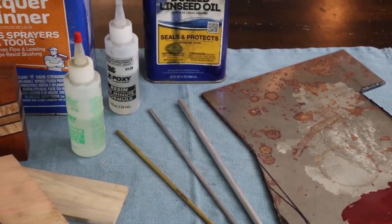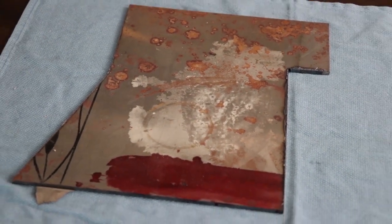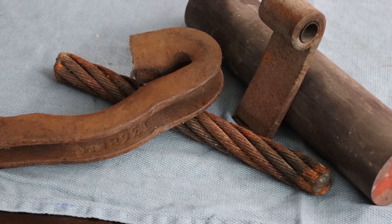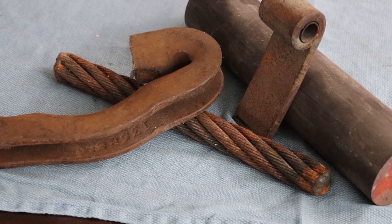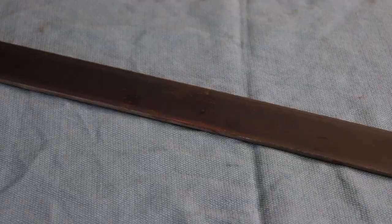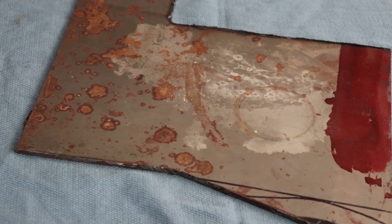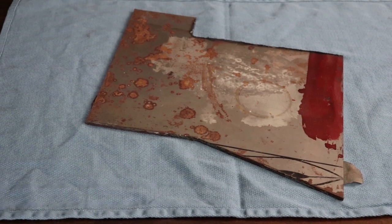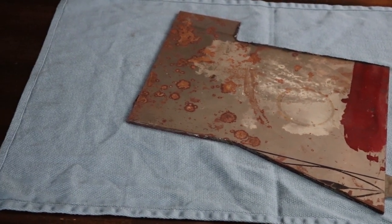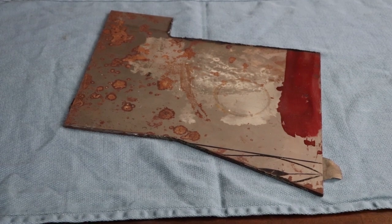That brings us to materials. Most importantly, you'll need a piece of flat high-carbon steel from the mill, like this piece of 1095. Since we're making a stock removal knife it's very important that the steel is perfectly flat — railroad springs, cable, leaf springs, truck axles, these are all a no-go for your first knife. And since the steel must be hardenable, grabbing a random piece of welding stock from your local hardware store won't cut it either. You'll need to buy steel from a steel supplier. I get mine from New Jersey Steel Baron or sometimes Amazon. For your first knife I'd recommend 1080, O1 tool steel, or 5160. I'll leave a link to New Jersey Steel Baron in the description.